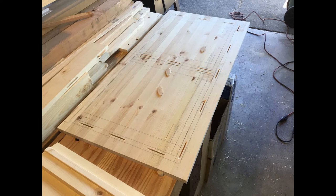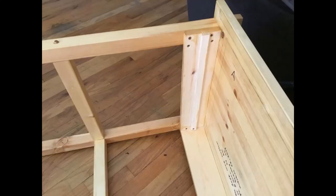And I saw, by the way, when you were putting yours in, was it tight? These biscuits are wood. If you have a garage with a lot of humidity, cold and dampness, they will swell. Normally, they slide in very snugly, and you don't have to hit them with a hammer. So I would say your biscuits got a lot of cold and humidity and just swelled up. Keep them in a closed container, dry, and away from harsh weather, and they will always be well formed to the blade, if you have the right blade in your machine.